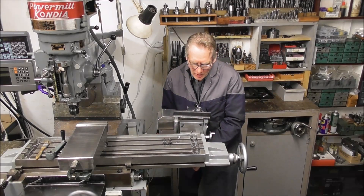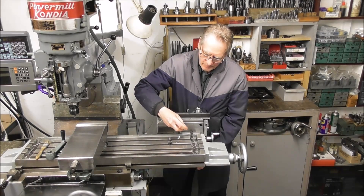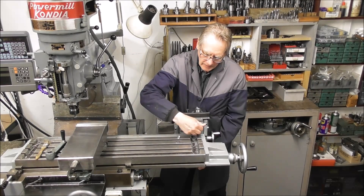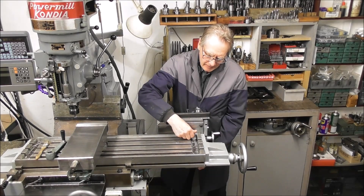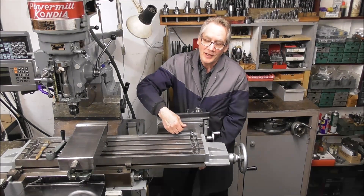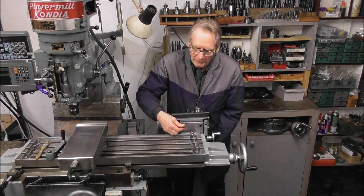Let's demonstrate installing the attachment — it's got to be pretty easy because you want to plug it in and out without any big drama. So you just slip the stud into the hole, hold it in place, slip in the top screws, put the nut on the stud, and set the helix angle — the all-important helix angle — so that the sweep of the cutter stays in the valley of the thread.